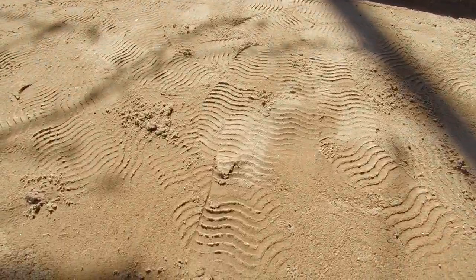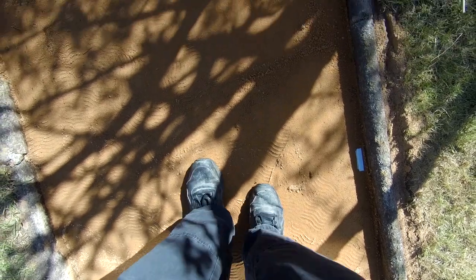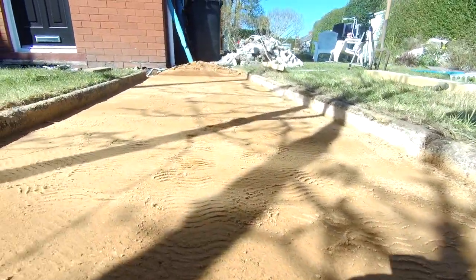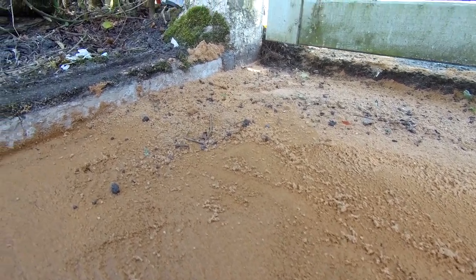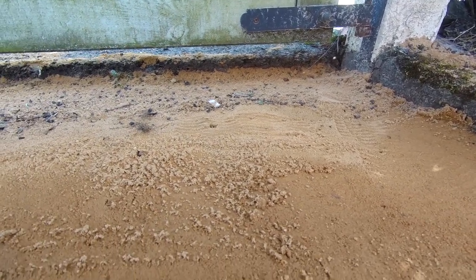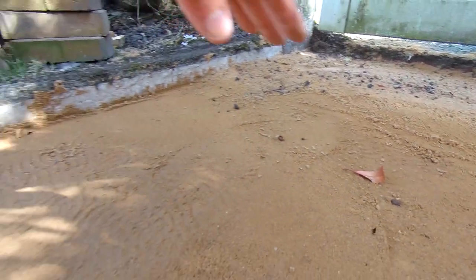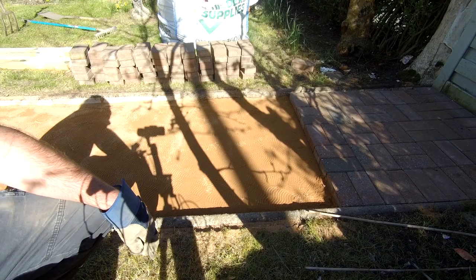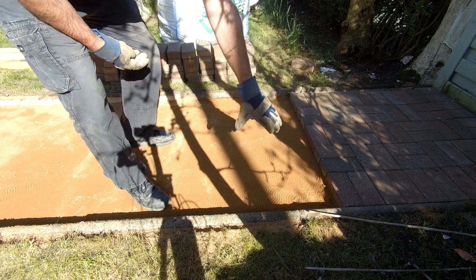We've got it pretty flat now — walked over it, very sturdy. We've got it pretty flat all the way along. The front part over here — obviously couldn't run it along the edges because you get to the gatepost — so I've got to work out how to do that bit. I'm just going to put a row of bricks down there so we can lift them later and level them once we've got the main part of this path down and level. Let's start putting some bricks down. If I ever get a low spot, just chuck some sand in and bring it back up.